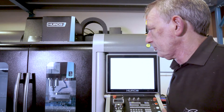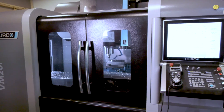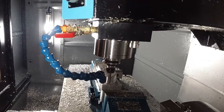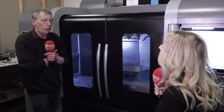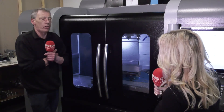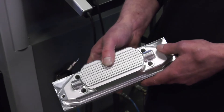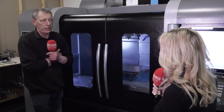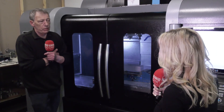And you're looking to improve the machine's efficiency in the future too. Yeah, with the fourth axis we're not in any way, shape using the full capability of the machine. With fixturing and tooling, we can produce multiple parts with the programming. We're changing the fixturing to using a tombstone on the fourth axis rotary so that we can load a whole car's worth of components in one hit and machine all of those in one go, rather than individual component machining. It's proving that it's worth every penny that it's taken to get it in through the workshop door — it's earning money and working and performing really well.